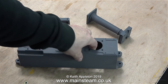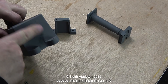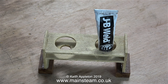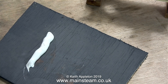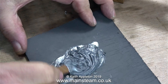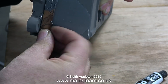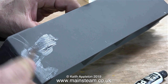The paint has dried but it's still not a good finish — I'm going to need to fill this. Before filling I would generally use etch primer first so you can see where you're filling. I'm not going to use car body filler though; I'm going to use JB Weld, which is a very strong two-pack epoxy resin. This is the 24-hour version, so it takes 24 hours before it cures. Here's a shot of me mixing it together — it's a two-pack mix and you must make sure that you mix the parts very evenly.